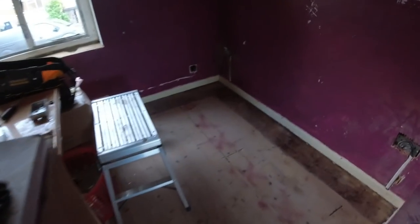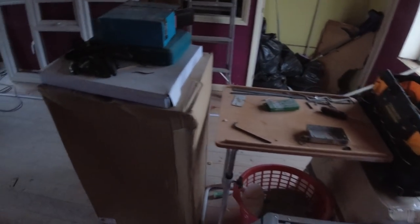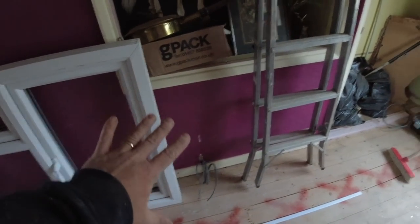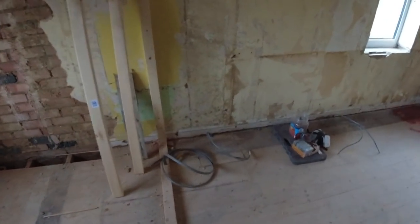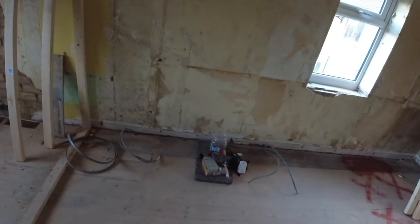Well, we've got to dash off now, but we have managed to get these ones roughed in, okay? In the end, I ended up changing back to the two blades because the five blades were slipping, as the chaser hasn't got the proper shank. There's no point in doing anything with these because I don't know what's going on with this wall yet, so we'll leave them. Managed to get the switch in the plasterboard wall, and then tomorrow I'll be back for not very long because I've only got literally one, two, three, four chases to do, and then that will be the first fix done on this job. So I will see you tomorrow morning.